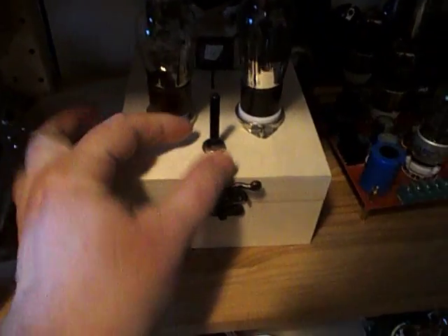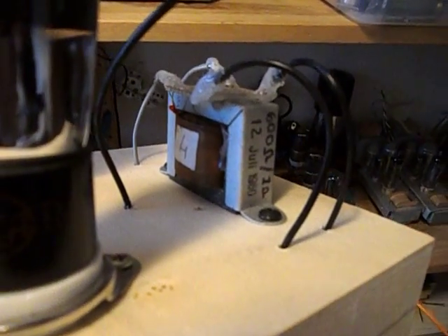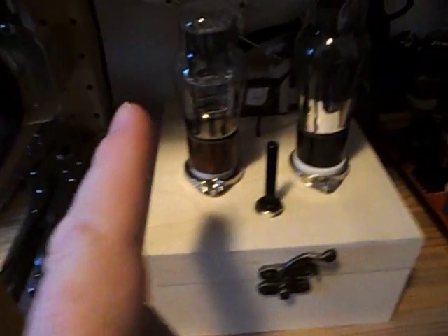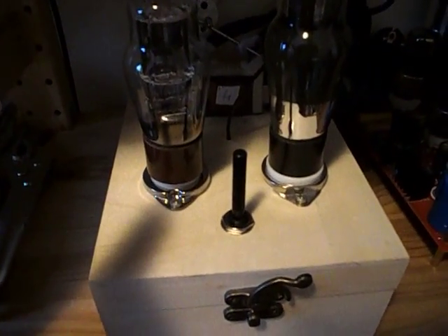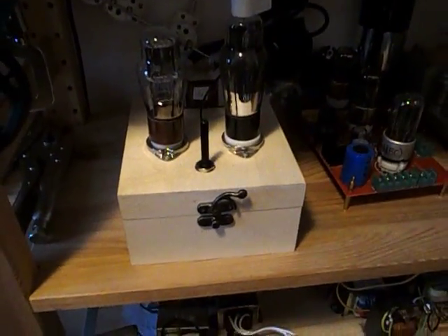I think this transformer has a lot to do with it too. This is the first amp, and this is an exact clone — a Kool Duke Clem clone. The transformer might not be enough for this one. So I'm going to try using this type of transformer here and compare, to see what kind of gain I get. Because I'm getting much more from this one PCL86 than I am from these two. I'm going to do a 6C6 pentode and a 1626 triode.